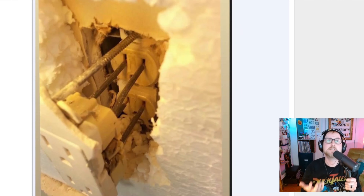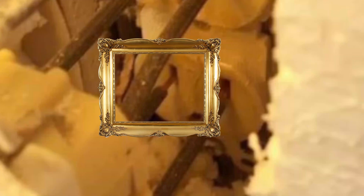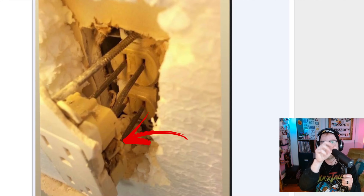They put the styrofoam in and then got an outlet and were like, what do I do here? So they grab a couple of what appears to be old wire jumpers between the two outlets. You can see in the bottom left of the back socket there's a little bit of wire exposed. Then they just shove it into the back of the front outlet — the back has quick connects, where the wire just quickly grabs it. It's not really a good way to do anything.